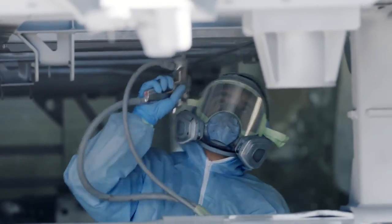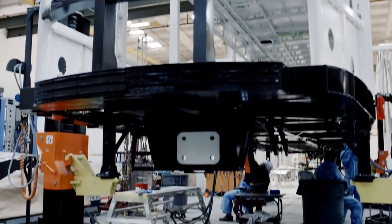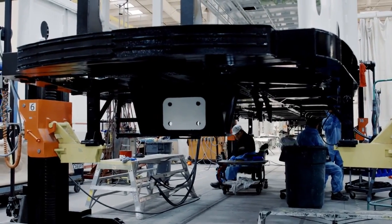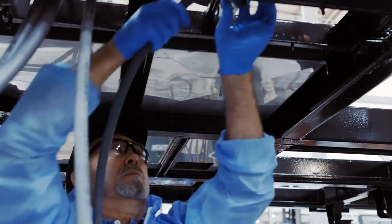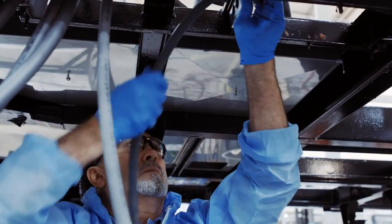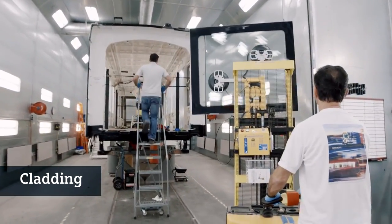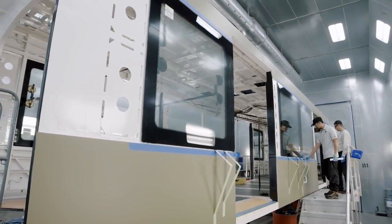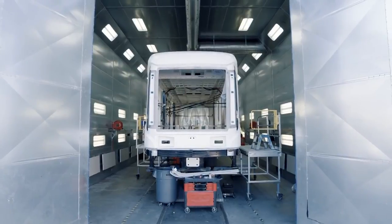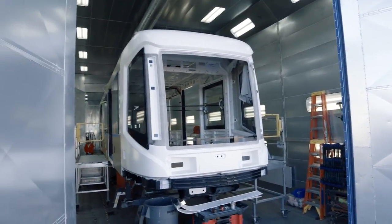After the priming process, we paint the car shell. Once we're done painting, we start installing the insulation in the floors, and on top of the insulation we put the heated floor panels, which was a special request from Calgary Transit to help with the cold winters. After the flooring is put in, we take it into a cladding booth, where we install the aluminum skin that goes around the outside of the vehicle. We also put the front mask on, which was another Calgary highlight — it's shaped in the form of a hockey mask.